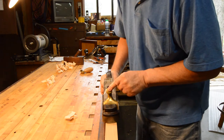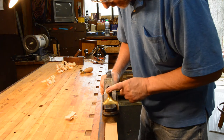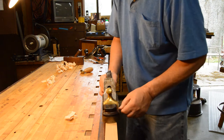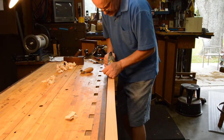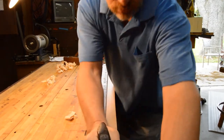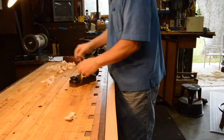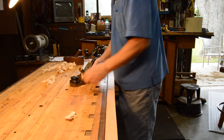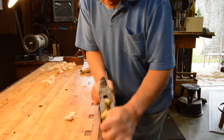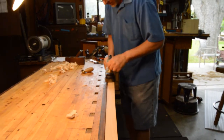There is a theory that if you tighten the hold-down screw, it makes a microscopic change in the depth of cut — tightening or loosening — without having to manually reposition the iron. Tightening made it thicker. Loosening it back — okay, so maybe that's working as advertised.